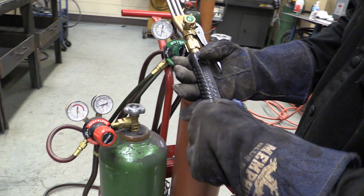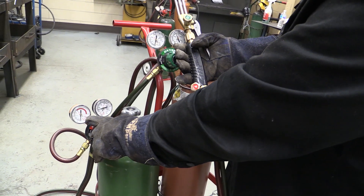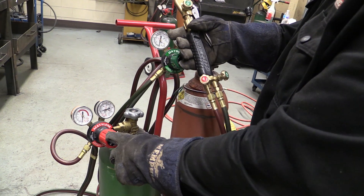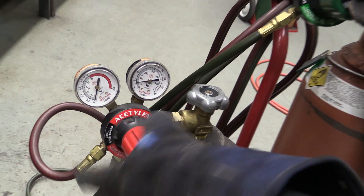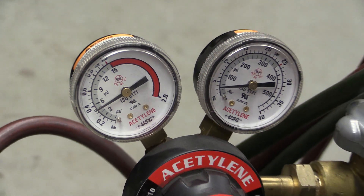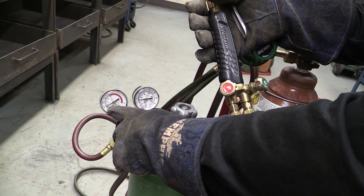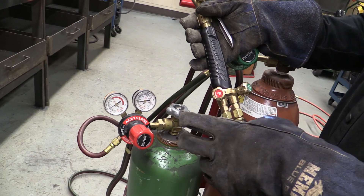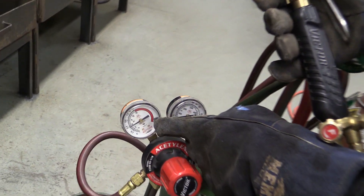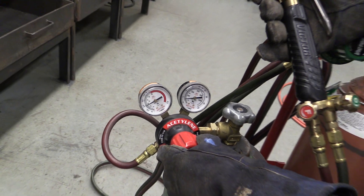First thing I'm going to do is open up the valve on the torch to allow gas to flow through to set my working pressure. So the first thing we're going to do is set the acetylene — I'm going to crack this open. There's nothing coming out yet because I haven't adjusted the working pressure. There's tank pressure and there's working pressure. Now I'm going to bring this in and you can hear the gas starting to flow. I'm going to set this at about five pounds, then turn the valve back off. My fuel gas is set at the working pressure I need: five to seven pounds. We only ever use five to seven pounds. What we never do is turn this up to fifteen pounds — see where the red line is? That's where acetylene gas starts becoming unstable when it's more than fifteen psi. Anything you do in this program, all you need is five to seven pounds.